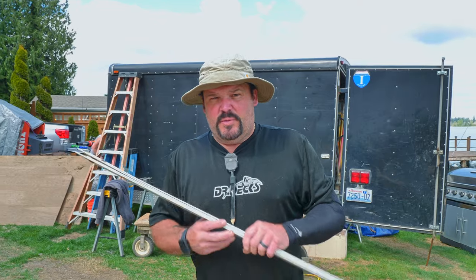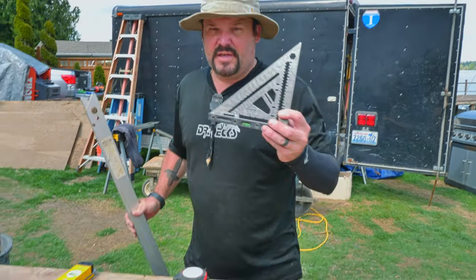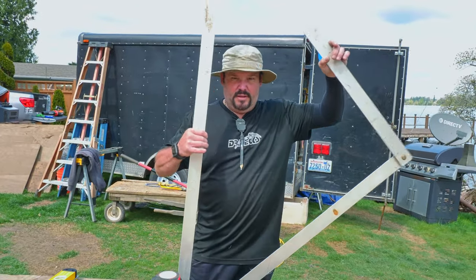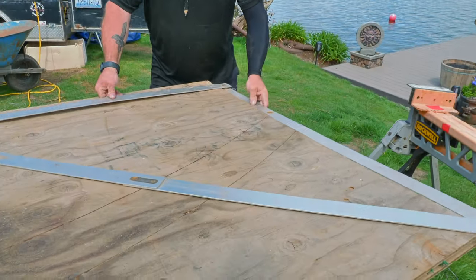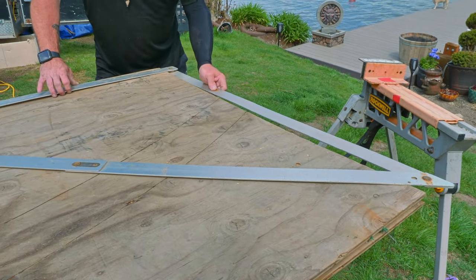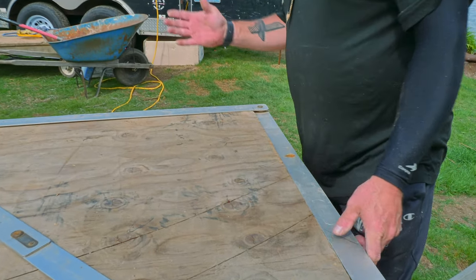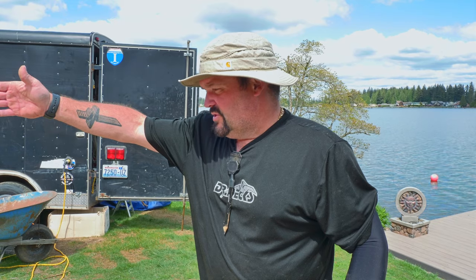Another way we do that is we have these large fold-out squares. Here's a standard speed square, but another way is we can take a fold-out square, pull it out and it locks — it basically does the same thing. It gives you a reference of squareness. If I pull this square right up against the side of this plywood and pull it to the edge, it's square. If I have a straight piece of 20-foot lumber, I can put this up against my foundation, put this out here, run my straight board right next to it, square it up, and check it with a 3-4-5 or 6-8-10. I'll have a square point off the foundation, so I know where my beams and footings need to go.